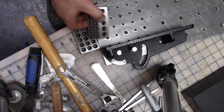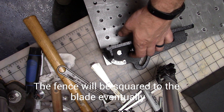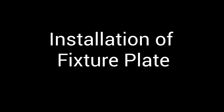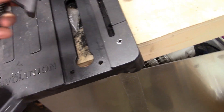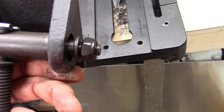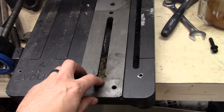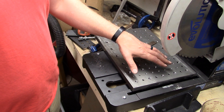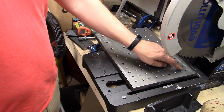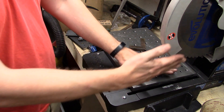I think that is close enough for what we are doing. It is not perfect, but I imagine this thing will mostly be used for situations where I am rough cutting stock to length. So I got the clamp off — normally it rides in a groove. I didn't realize there is actually a hole down at the bottom, and that hole runs in this plate. The plate is normally attached here, but I don't see how I can incorporate this. To get this thing totally level we need three points to support it. The greater loads are going to be on the side, so I am going to do two points here and one point here. Those three points will allow me to level this so that it is exactly 90 degrees to the blade.